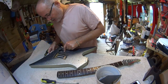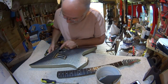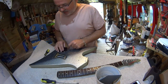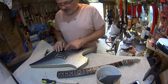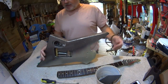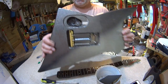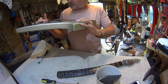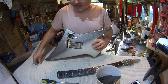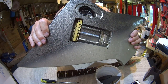It's got a little foil strip up there from the underside of the pot, so the actual cavity it's in is not shielded, but it's got a bit of shielding off the top here, which connects to the pot itself to earth it, which is quite cool. Give you a look in there. See? But we could shield that as well for good measure. Somebody, I guess, knows that maybe that's all that's needed. I'll maybe go over the top on that a little bit, but look at that brass block.